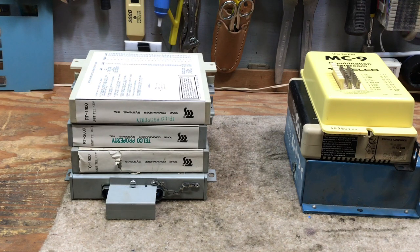For this presentation, I will briefly provide some descriptions of the following intercom units that are used with the 1A2 telephone systems. These were all outboard units manufactured by various companies to support the 1A2 systems that did not have built-in intercoms. Tone Commander was an intercom widely used in Oregon and Washington, and the other intercoms were used throughout the United States. Each of the Bell operating companies had their own preference of what intercoms they generally used.